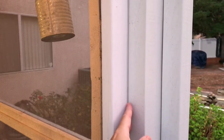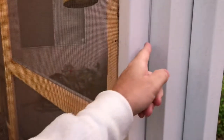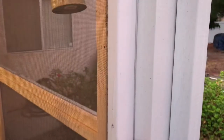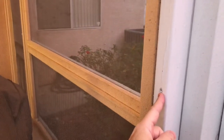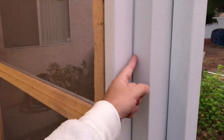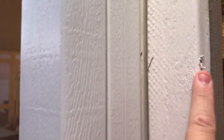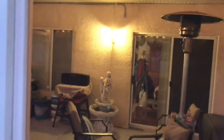These aluminum porch awnings come with this little groove that is the size of a 2x3. You put the 2x3 in there and you're going to screw it into the frame. Then you use a three-inch screw going all the way back into the wood right there — that's what's holding it from moving. There's a board right there and it's the perfect size, so it just fits fine. You put those in on either side of your beam post, and the three-inch screw goes back into that board, then there are screws going into the aluminum — those hold the screens in place.